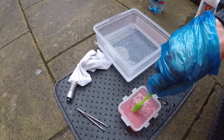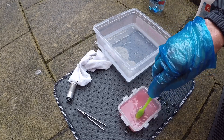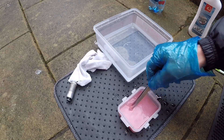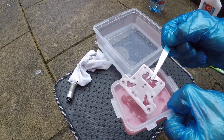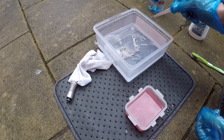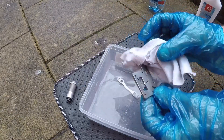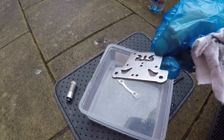Sometimes it can take 30 seconds, sometimes up to two minutes — it just depends on your mix and how deep your anodizing is. You don't want to leave it in too long because it can actually melt the aluminium. I think that's plenty for this — let's get it out with the tweezers. It's bubbling and temperature is coming off it. As you can see, it's nice and shiny — the Ackerman plate is also nice and shiny. There's all the anodizing in the water.